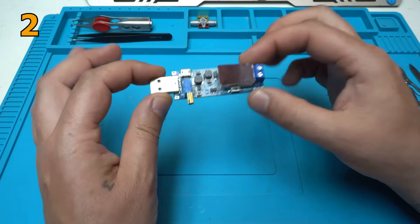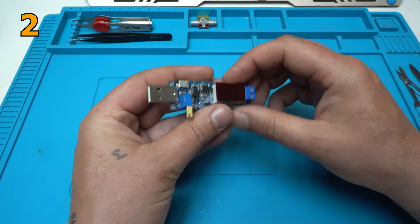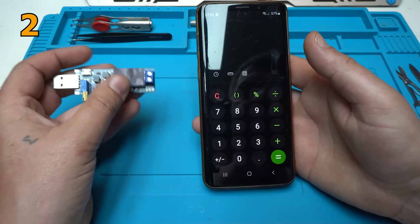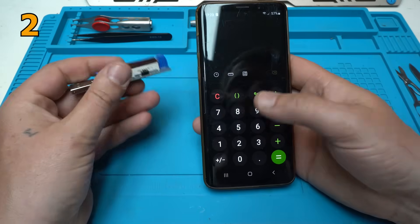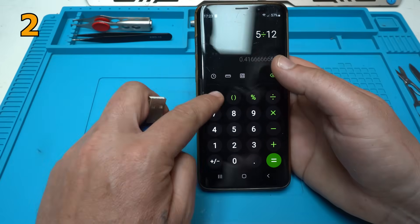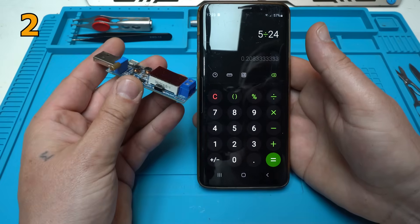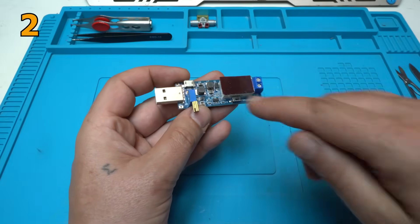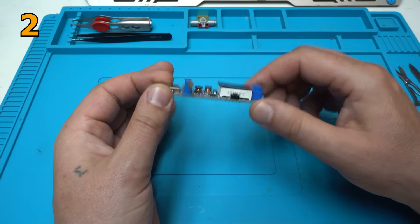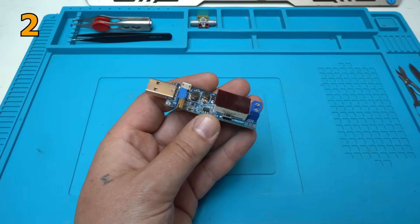Many will ask how many watts this module is — it's 5 watts. That means if you have a 5 volts DC input and you want 12 volts output: 5 watts divided by 12 volts gives you 400 milliamps. 5 watts divided by 24 volts gives you 200 milliamps, meaning that at 24 volts output, the maximum current will be 200 milliamps. Nice and portable — all the links will be in the description below.